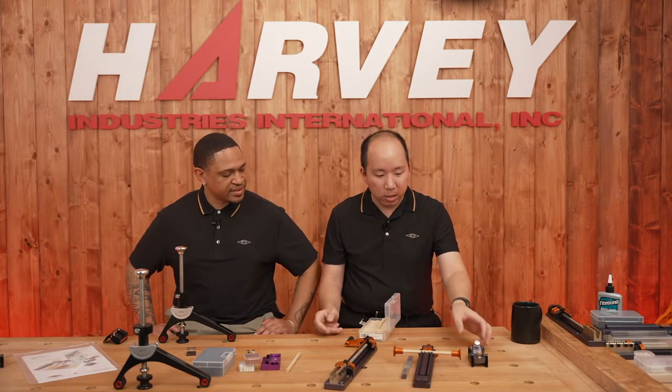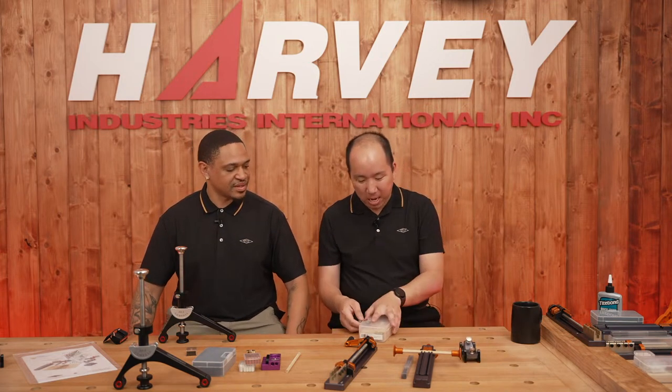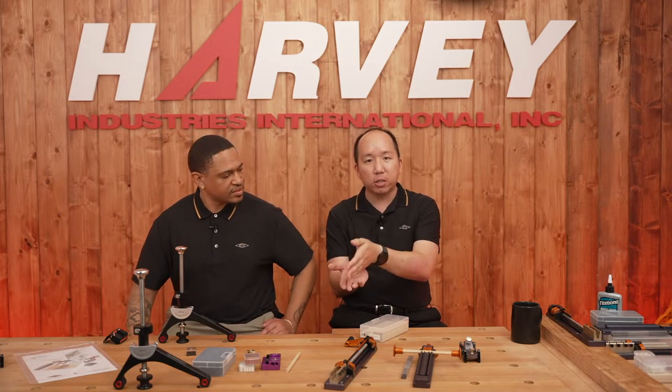Avoid using a hardwood. One, it's expensive. Two, some of the exotic or harder woods have grain patterns that could be a little uncontrollable. So when you're planing it down, it might not come out how you want it. It might be too messy. So softwood, preferably something that's easier to use, where the grain patterns run a certain way and aren't all over the place. That's realistically what you would be looking for. Again, what we use here is poplar. Great question. Let's see, any other questions that we have?